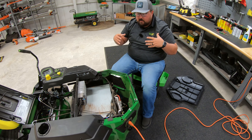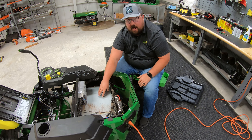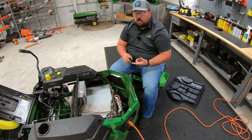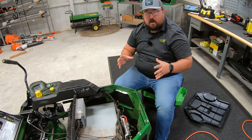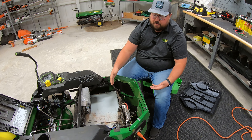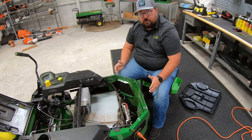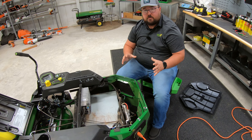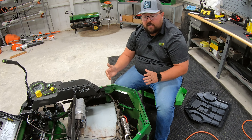A common question is: can I wash this mower? Yes, you can. This battery has an IP66 rating — ingress protection — meaning it is fully protected from dust and fully protected from water, so there are no issues washing it. Also, with lithium-ion batteries there can be concerns about charging temperature. You will not have any issues charging this battery anywhere between 32 degrees Fahrenheit and 114 degrees Fahrenheit.